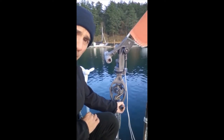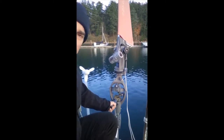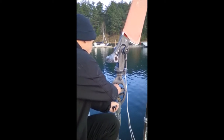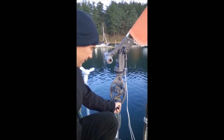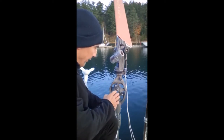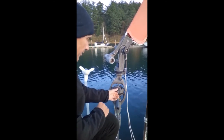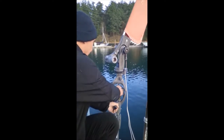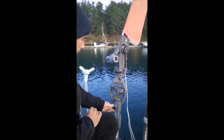So if you're in waves, you may want to get more rudder on this boat. I put it in the middle setting, but if I'm in bigger waves then I'll need to have more rudder on my 26. Most of the time I had it in the less rudder angle, unless I was getting chased by 15 to 20 footers on a broad reach. So that's effectively the gearing - from neutral to lots of rudder, and then I can move the thing and it'll give me less rudder.